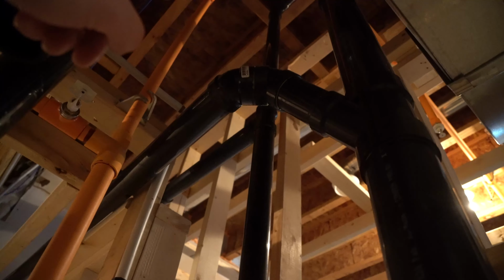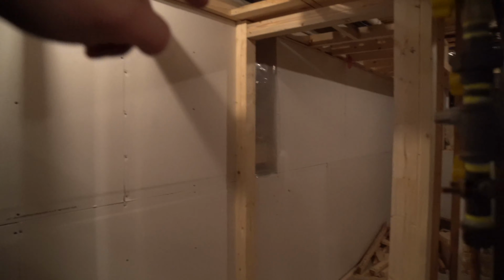Now here's another cool thing. So after all the drywall's done and the insulation's in, we've left some room that we'll be able to sneak in here if we really needed to. And if you climbed up there, you could technically get up into the drop ceiling right there to run wires. I'm doing a conduit from there to the sub panel, from the sub panel into this room, so that way if we need to do any wiring we can. I even thought about having the sub panel somewhat right here or just over here in the hallway with a closing spot. We'll see.